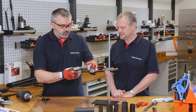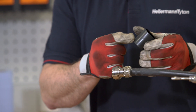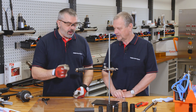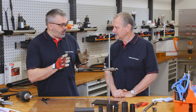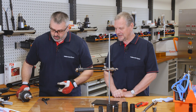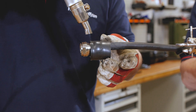These can be post-installed over a cable harness that's already prepared. We have an H and a J marking so you know which end is which, and also a rib. This is a high temperature adhesive on a high temperature material — it will stand up to 200 degrees Celsius in a working environment, perfect for aircraft engines. We have ASA 5049 approval and it's already supplied into the aerospace industry in large quantities, so it's a proven product.